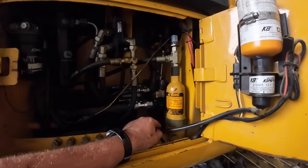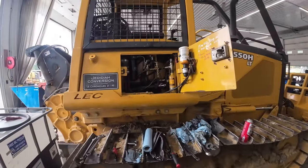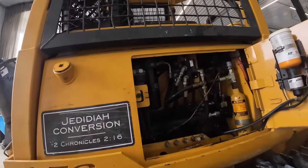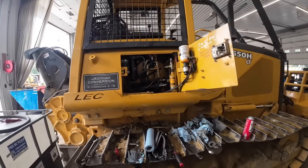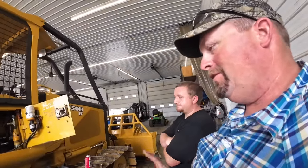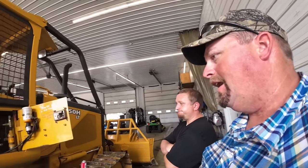Talking to another guy last night, if it does it again, I'm going to check the head pressure. Basically, that means when it's sitting there idling, it shouldn't be building up much pressure, like a couple hundred pounds or less. But I know originally I went back in the videos and watched, and it didn't have any of that. I took this filter out the first time, but I just need to quit talking and go run it. See what happens. It's got all new hoses everywhere on it, so it couldn't be a hose, at least in the loop system for the hydraulics. So I don't know, we'll find out. Next clip.